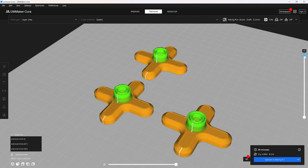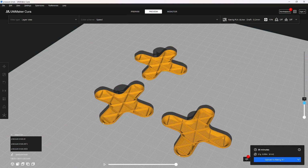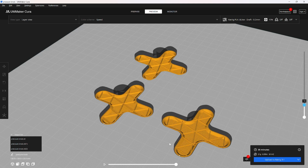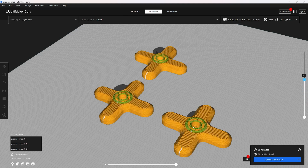And then this one you want triangle infill because that'll give you a nice solid area right underneath where the screw starts. Sometimes when you do cubic, it misses that spot, and so if you over tighten it, it just kind of punches into the hollow cavity that is there. But this way, now it's supported all the way through, straight from the screw.